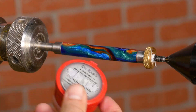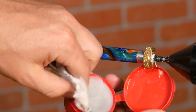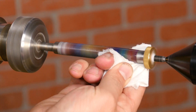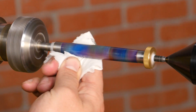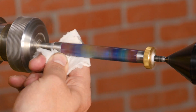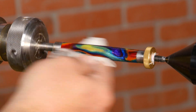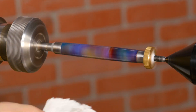Now I'll finish with Micromagic. First up is the red jar — it's a three-step polishing wax that produces an amazing finish on acrylics. Apply a fair amount on a clean rag and polish with moderate pressure. Stop the lathe and polish laterally. Repeat these steps with the white polish, then the blue.